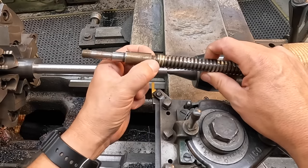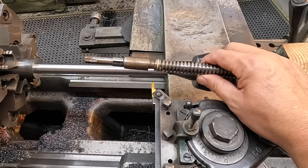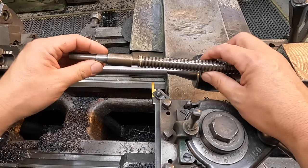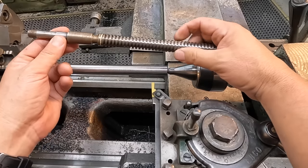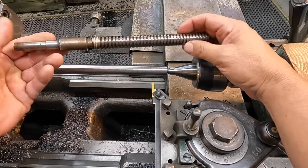This is 1/4 inch, so it's a 1/2 inch diameter down in the bottom, and that'll suffice too for the Acme thread. So we'll just go ahead and come down here and do a nice wide undercut there, a thread relief, so we can start our thread.